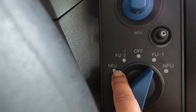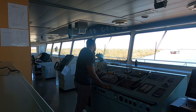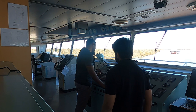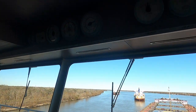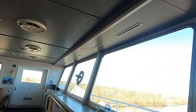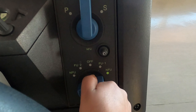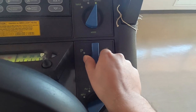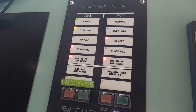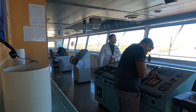Try out the NFU mode — same as manual mode — and confirm the helm orders with the steering gear room. Then ask the engineer to try out emergency steering from the steering gear room: keep the tele-motors off on the autopilot system, let the steering room take over control to local, then give them various helm orders and check whether they are following up correctly on the rudder angle indicator. After steering checks, check the emergency power supply — take load on the emergency generator and one steering motor should be able to work with the emergency power source. Test all alarms on the steering motor panel, which is a mandatory requirement for vessels navigating in U.S. waters.